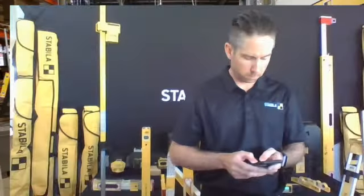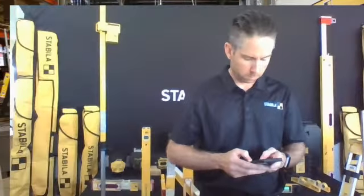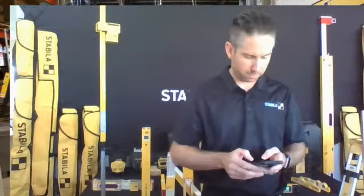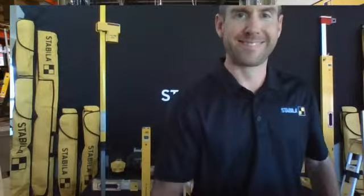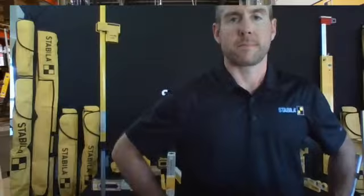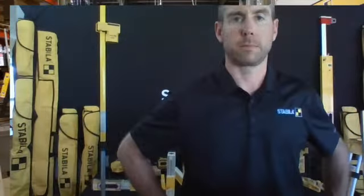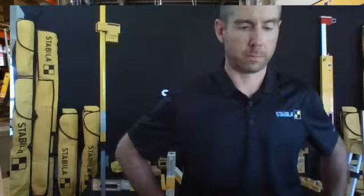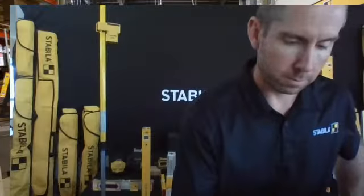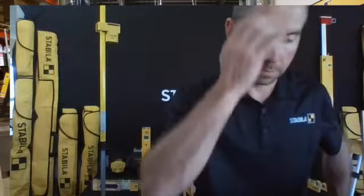So I'm just going to go ahead and check my walls for fun. The carpenter built this one and actually did a pretty nice job. It's actually perfect. So now what we're going to do is check it before. This is why this step is so important. This is the first time we actually set the exact opening size we need, in the case of a carpenter doing the jamb installation. So we already know that I had to set at 34 inches, so that's jamb to jamb. I'd actually set it to 35 inches.